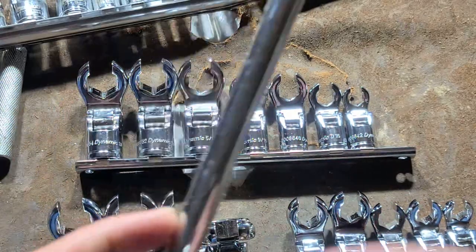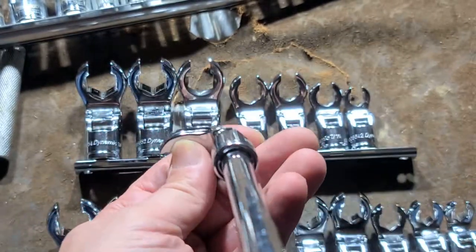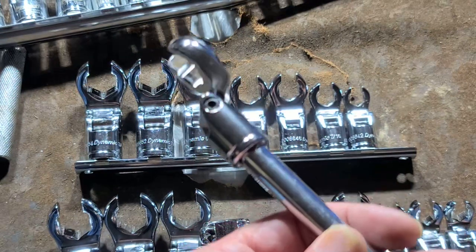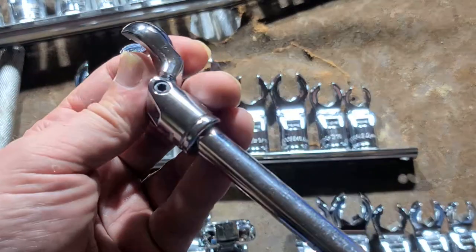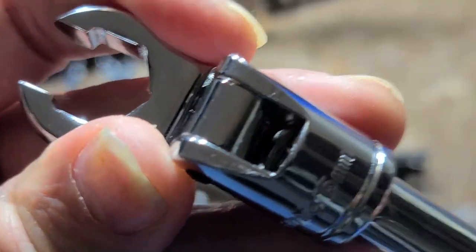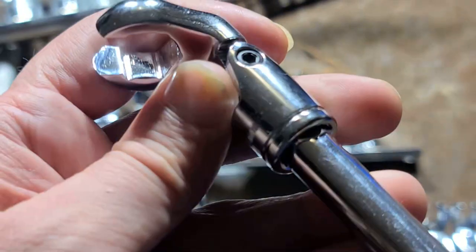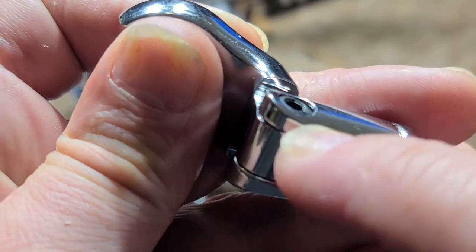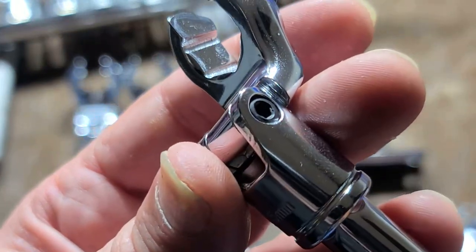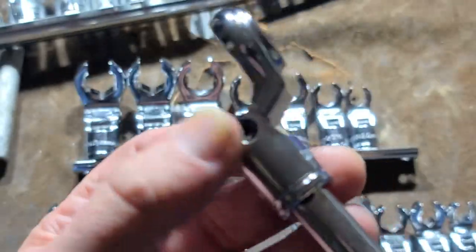When running these tools, they're just designed to make it easier to access awkward angles — you'd use these with a ratchet or with an extension and can get them at just about any angle you need. But if you ever use them like a standard right-angle wrench, like a normal crow's foot, what I've seen online is that's the easiest way to break these, because you have all this stress in a narrow area. Rather than a twisting force, a bending force here really just wants to pull this socket apart, and oftentimes will shear the screw. I think that's why they use a screw — the intention is that in many situations the screw will end up failing and you can replace it.